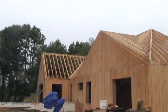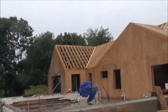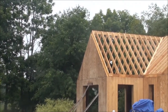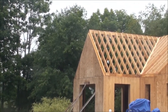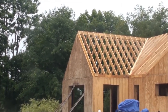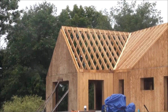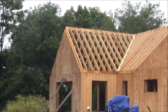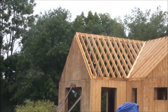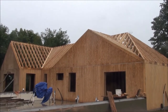So if I can get back here so we can see — this is a gable end right here over the area where the chickens will be mainly housed. That's a 12/12 pitch, meaning that for every 12 inches along horizontally the roof raises 12 inches. And this section over here is a 6/12 pitch, so this roof is a different pitch.